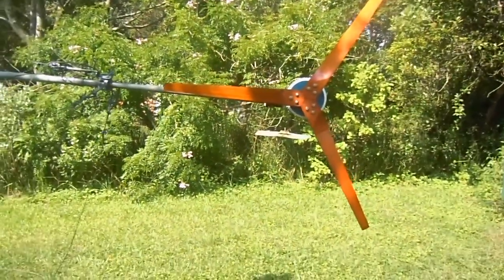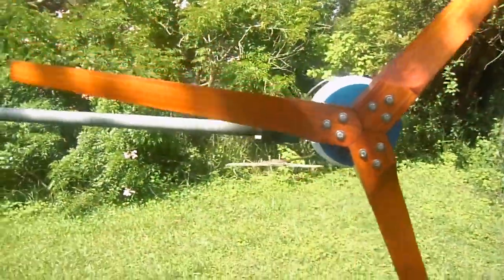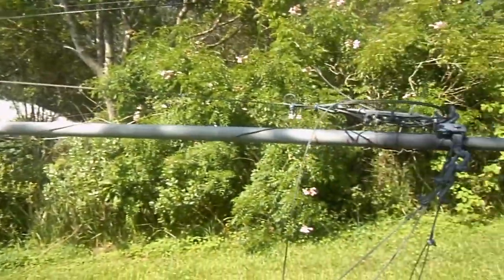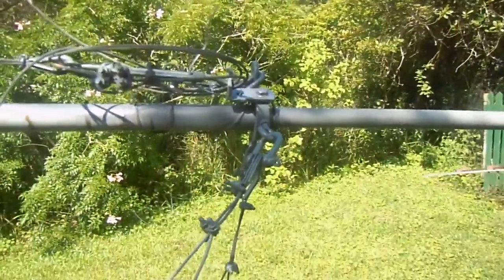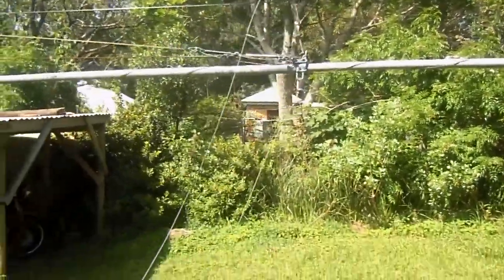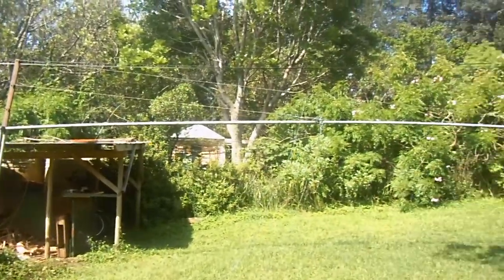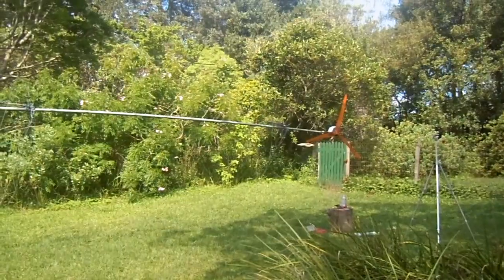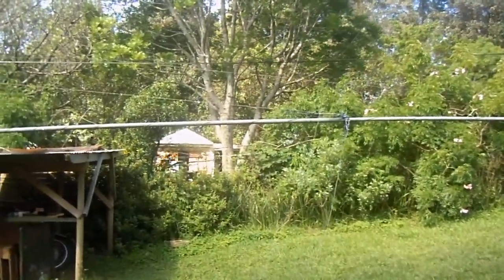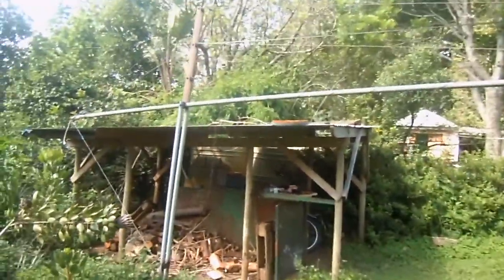The tower takes the machine just under 10 meters off the ground. At the moment it's in the horizontal position. The tower works a little bit like a crane — it has two places where guy wires attach further down, which is important. If I go a little further away, you'll notice how this pole bows because the alternator is roughly seven kilos, which is quite considerable. On the top there's another set of wires which prevent the pole from bending too much.